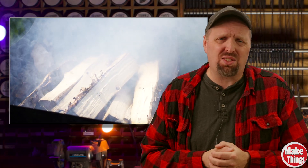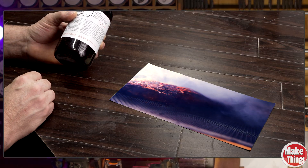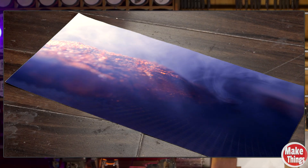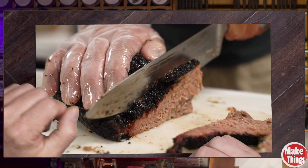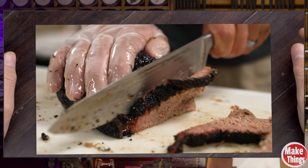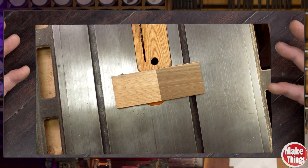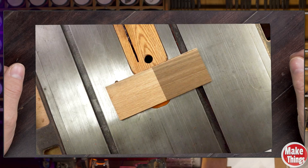But what's actually happening when the ammonia hits the wood? Ammonia is an invisible gas, so it's really tough to picture. Instead, let's look at something we can actually see — smoking a piece of meat. You can see the smoke enveloping the beef. As it cooks, gases react with the meat's surface proteins. That thin red ring? The color isn't paint or seasoning, it's the smoke itself changing the meat from within. Ammonia fuming works almost the same way — the vapor reacts with the wood's surface tannins instead of proteins. A gas triggering a color change from just beneath the surface.